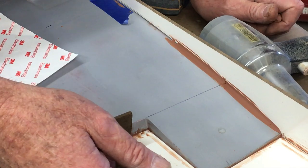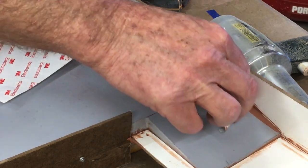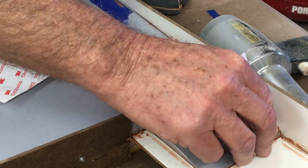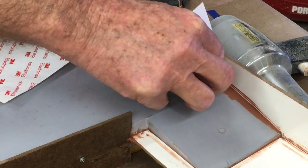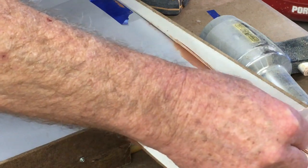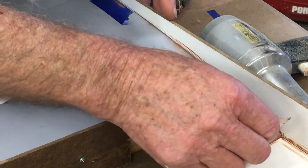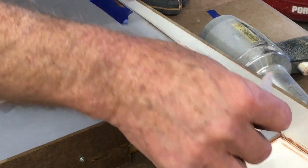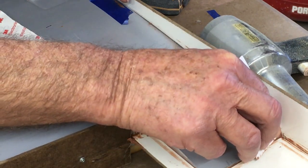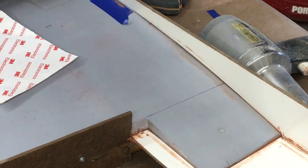What I do is I under-support everything — I put tape on the bottom right up to the lip where the parting plane is, and then I run hot glue in strands across it. That pretty much reduces the clay from getting loose in there. So I'm just gonna come down and take some of this out. It's getting into the panel line here so we'll have to dig that out — that's pretty easy. I've got the rivets masked. Let's try and reduce this a bit. Different guys have different methods in how they do this. This is how I've always done it — I've tried some different methods without much luck. I've cut my card so I've got a real clean, sharp ninety degree edge.